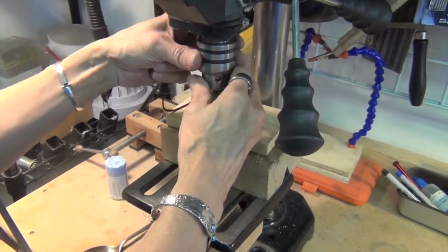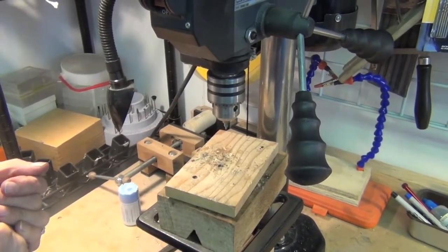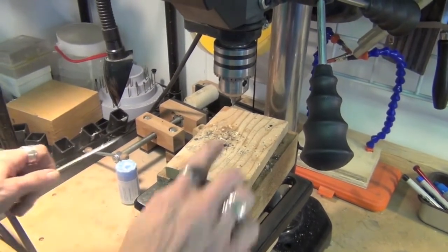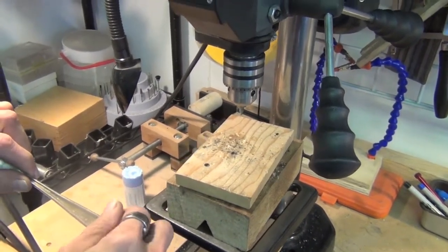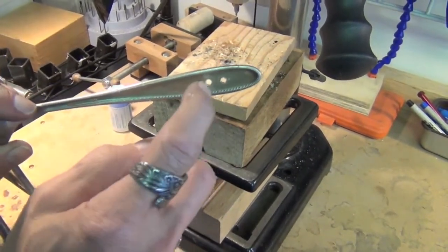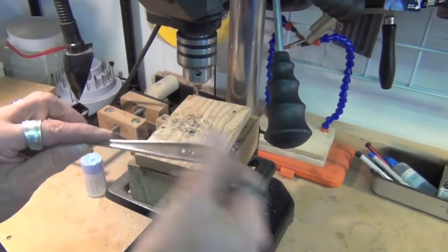Again, keep the bit chucked up high into the drill chuck. There are two tips on the countersinking bit: you've got this small starter tip and you've got this wider tip. You do not want to drill all the way through with the wide portion or you're going to create too large of a hole. One nice thing you can do with the countersinking bit is remove some of the burr on the back — you can drill on the backside and remove burr from holes you've drilled. Just tap it a little bit and the burr is removed.